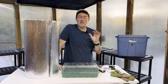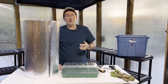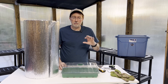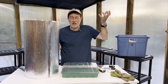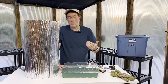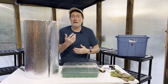The next thing is that the automatic foundation vent is obviously going to help with airflow. One thing you could do is put a foundation vent on the opposite side of one — you might have an airflow effect. It's not going to be a big airflow effect, but if you have one on the top and one on the side, the air escaping out the top is going to pull air in from the side. I didn't make one of the two vents, which you could easily do — it's just going to double the price on your vents, but it could also increase natural airflow inside. It's not going to be a gust of wind, but it will be a kind of natural airflow happening.